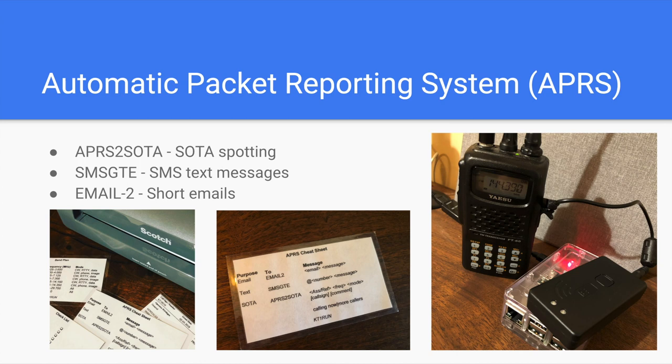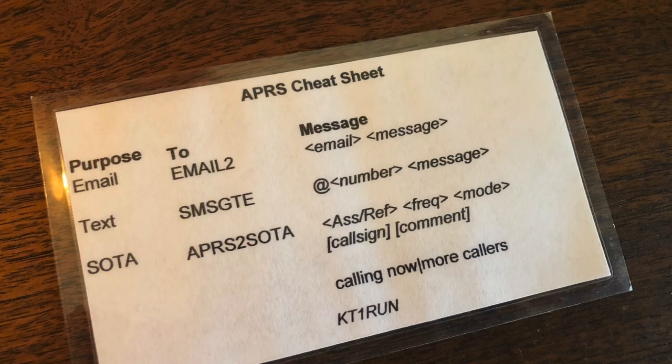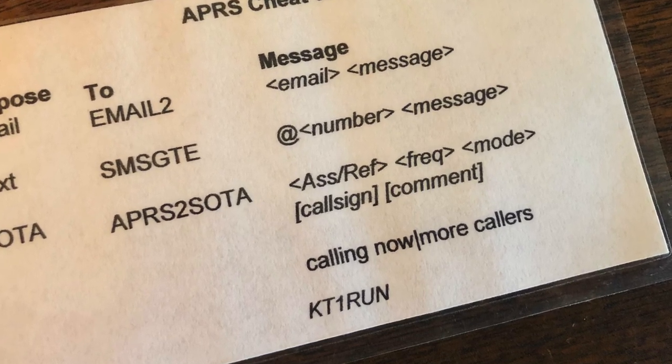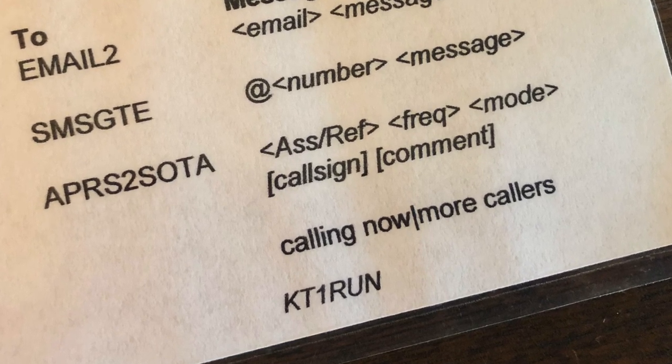I could literally turn on my radio, put it on the APRS calling frequency, connect to the MobiLink, and send a special message to APRS-to-SOTA. The packet format was: your peak designator — Whiskey 7 Alpha Stroke Mike November 061 — your frequency, say 144.410, the mode of operation FM, your call sign, and a comment. I was able to spot myself, send this out, and all of a sudden I had a pileup. I had people across the country monitoring these spots, able to see exactly which frequency I was on, and all of a sudden I had like 30 contacts not long after my first attempt.